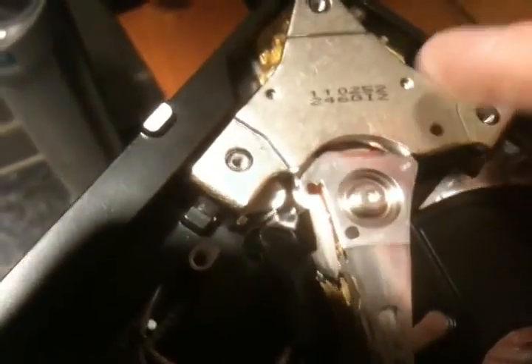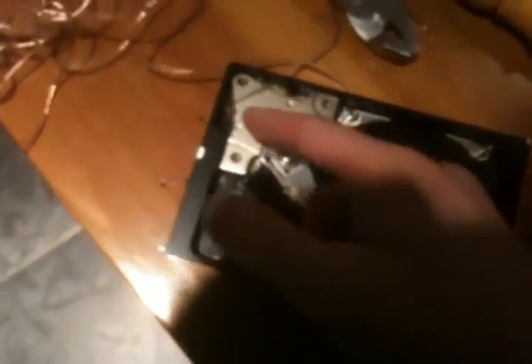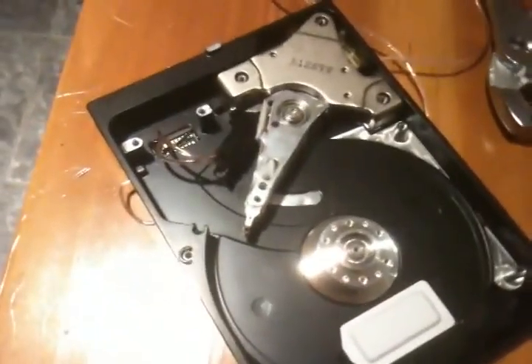What I've also done is — if you look in some hard drives, you'll see little pillow-type things. I've stuffed one right there to help dampen noise a little bit, and I've also stuffed one in there to help dampen more noise, because these little things rattle. I've also stuck them down under this magnet, around the actuator, so that it doesn't go to the park position — because when it goes to the park position, all the sound resonates to the little lock that's on there. So what you want to do is get the pillows in there so it secures the actuator in place, just enough so it doesn't hit either side of the lock. Because in this particular hard drive, the lock is made of plastic, and plastic does not sound pleasant.